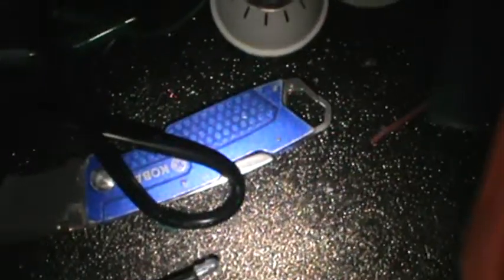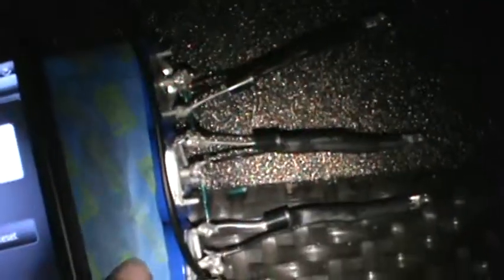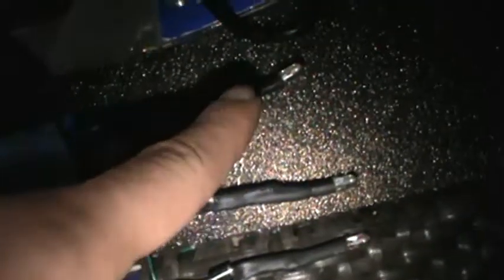And you can see that all the LEDs are looking pretty dead, but that's just because the voltage is too low. Because like I said, each capacitor holds about almost 3 volts of electricity, and that's what powers these 3 volt LEDs. But since they're below 3 volts, that's why the lights are dim and they're not showing right now.